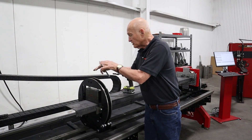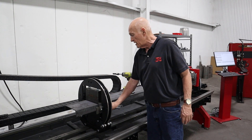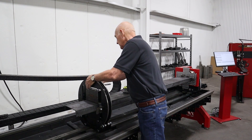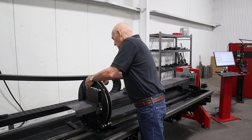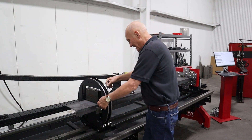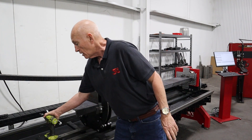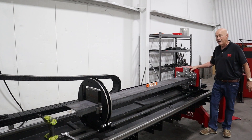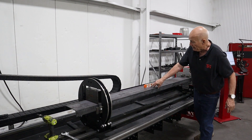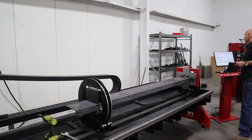I know it looks a little hokey using this piece of box tubing, but sometimes the simple solution is the best solution. All I have to do is take my wrench — I don't have to snug the top down too tight because gravity is helping us out. I snug up this one a little bit, then tighten up the ones up here — there's one, there's two — then put the final tightening on the front one. Right now we're secure. In the real world on initial setup I'm going to have to adjust the entire power head up or down a little bit. You put a level on your workpiece and adjust until it's showing level — which it is — and you're good to go.